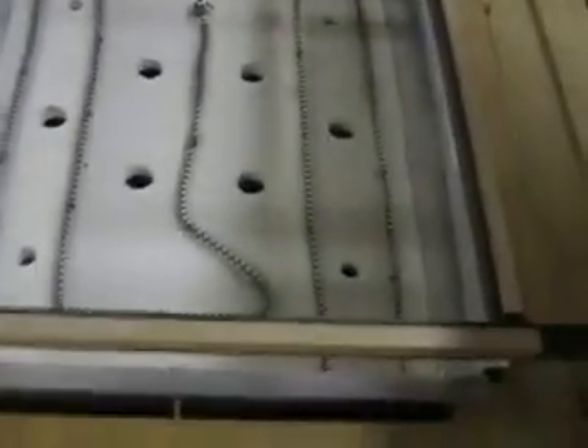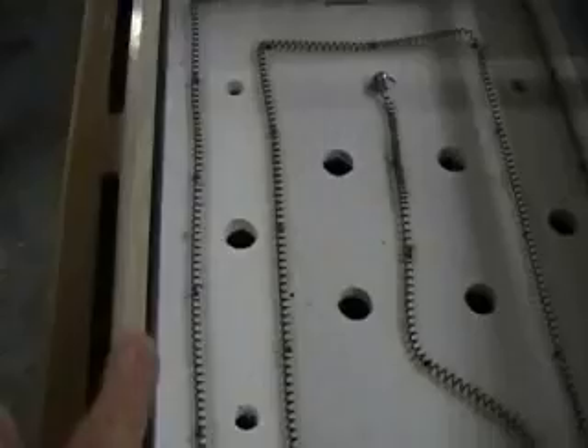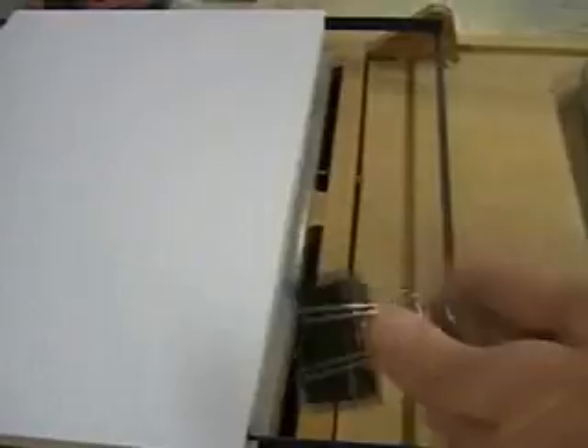Here I am preparing the ABS. When I got this machine it was just square angle iron, and so I can hold my ABS on it — I went ahead and added balsa square, which gives me a good place to clamp on to. I use 18 by 11 sheets — this is 0.060 thickness, because I'm pulling a really deep draw and I want to be able to go all the way around without getting too thin. I just lay this on, then I take big heavy-duty paper clips from OfficeMax and clamp all the way around — four down each side and three across the back.